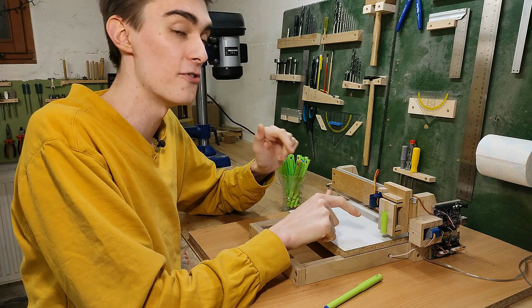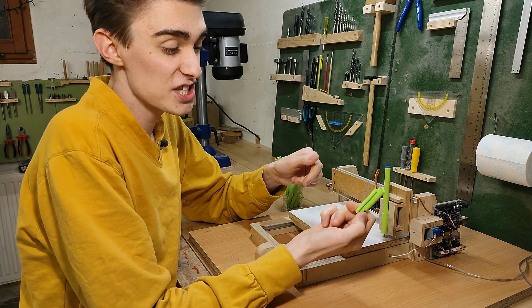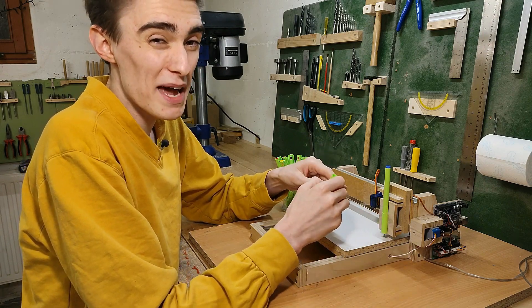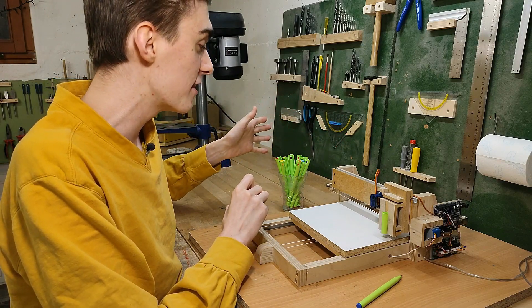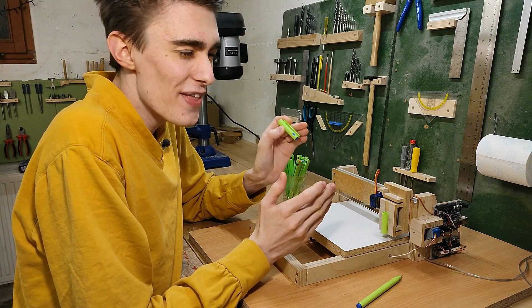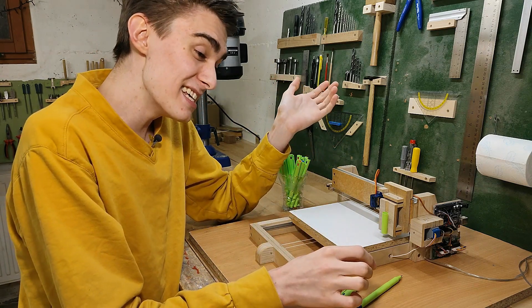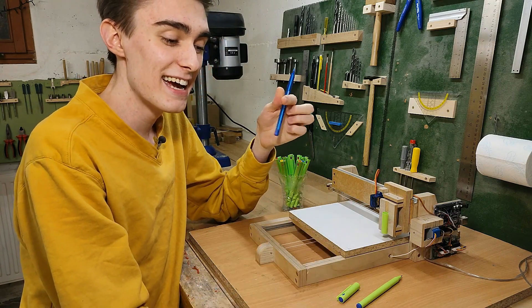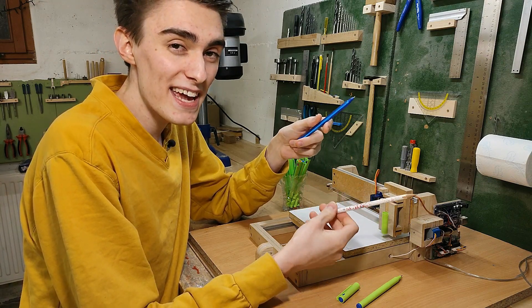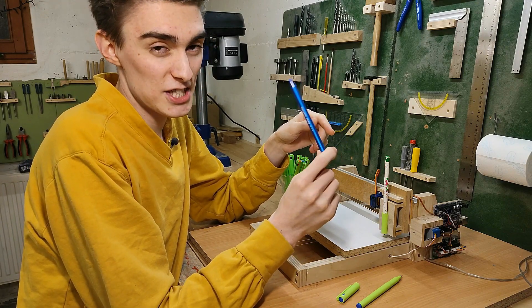The last con I want to talk about is the pen holder. Initially the idea seemed very slick — just being able to take the pen, pop it into the machine and start printing. Basically what I did was cut off one of these lids and hot glue it onto the machine, which does make for a very nice quick release. The idea being, since I have these pens in all kinds of colors, I could just take whatever color I like and put it into the machine. However, that basically makes the machine only work with proprietary ink cartridges, which really sucks. Because in reality, sometimes I really want to use some other kind of pen, like a ballpoint pen or even a pencil, and they just don't fit. It really would have been better to make some kind of screw clamp thingy like you get on cheap compasses, so I could at least use pencils whenever I like. And with enough complaints for now — it was my very first CNC project after all. I'm just so much better at detecting stuff that could be improved on a project while simultaneously taking all the good things for granted.